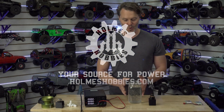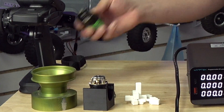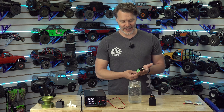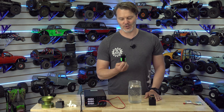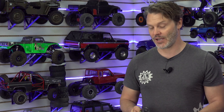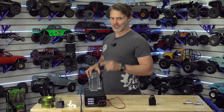We already had a video where we go over why I don't like the water break-in method. I want to preface that if you have a sealed can motor and you're willing to at least squirt it out with WD-40 and re-lube with three-in-one oil or a zero weight oil for engines, you could actually do a water break-in. On a sealed can, it's about the only way to really get it done well. If it's fast and you're racing, maybe I'll give you an exemption — but you're going to have to totally clean it out with WD-40 and then re-lube your bearings. So that's where we start.